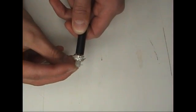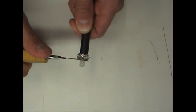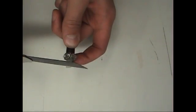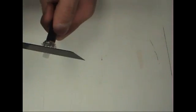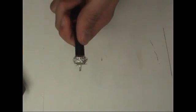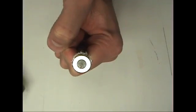Place the second washer over the cable's dielectric, then use the washer as a guide to cut the dielectric. Once a complete 360-degree cut has been made, you can use the knife to pry the dielectric off, then use your hand to pull the dielectric straight off. Do not twist the dielectric, as the center conductor is made up of multiple solid wires — twisting could cause them to come out of alignment.